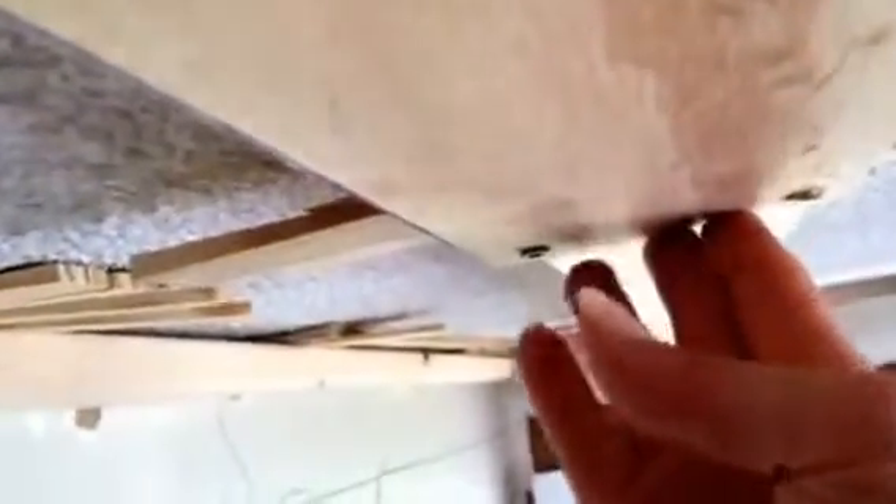Another hint: when you put your shims in, this is a quarter-inch flat shim, but a regular shim is wedge-shaped. You'll always want a matching shim going the other way on the other side so it's nice and flat. That gives you a nice flat meeting place where your boards match up, so your ceiling is nice and flat.